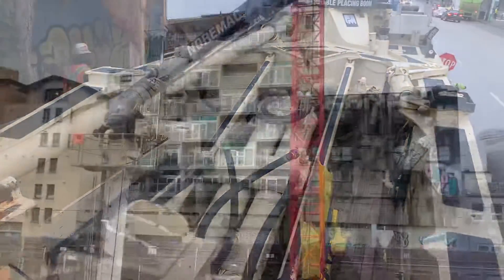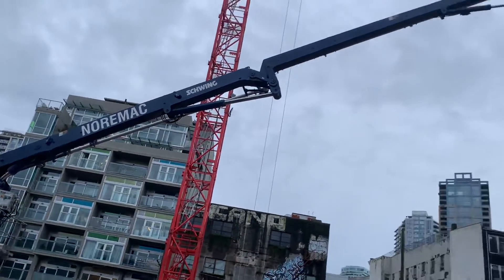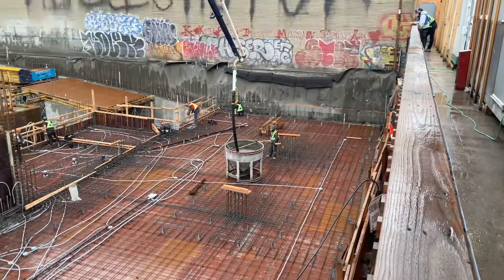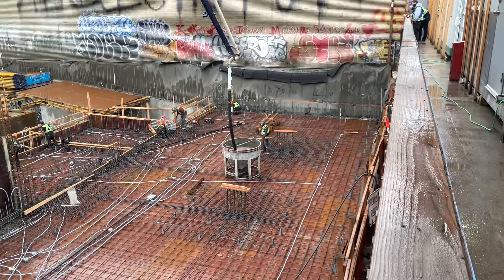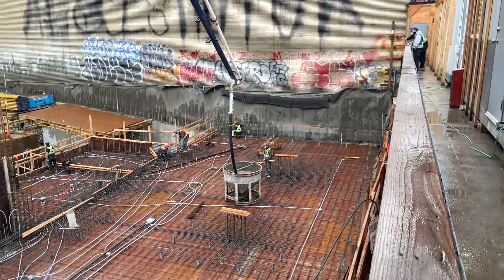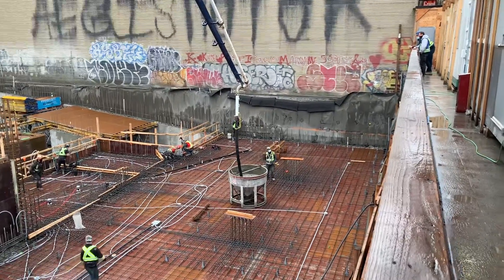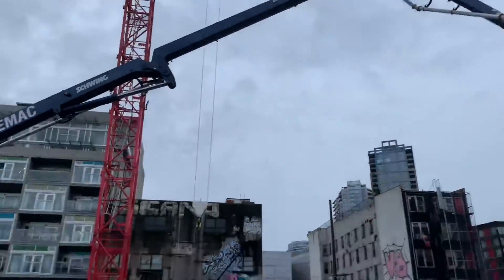Back to pumping — we're still waiting on concrete. We don't put the grout through until we've got the concrete ready to go right behind it. What we do is pump the grout into a bucket, but we always put a piece of poly in the bottom of the bucket, otherwise the grout will just infinitely leak through — the bucket doesn't seal tight enough to hold grout; it's just too wet, too viscous. Other than that, it's pretty straightforward: pump out that first meter of grout into the bucket, then swing over and start filling the deck with regular concrete.